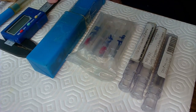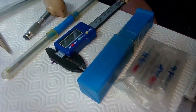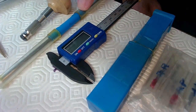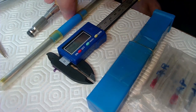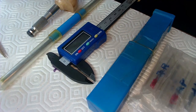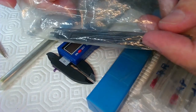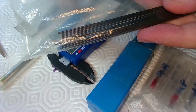I'll need a measuring device to determine what size of material I need for the new staff. I'll need a burnisher and file to finish off the balance staff, a handle to grip the gravers, and some stock material equivalent to the widest diameter in the balance staff.